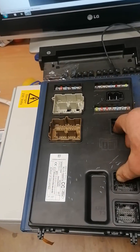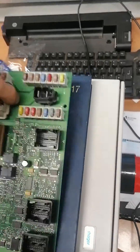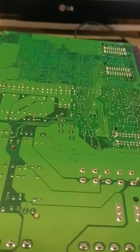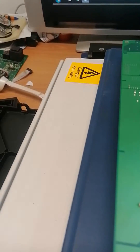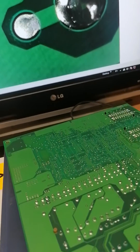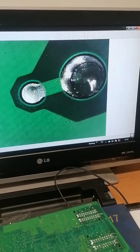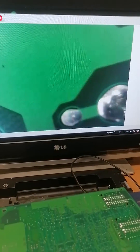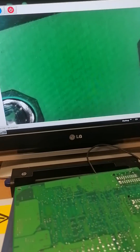I've taken this out and we'll have a quick look at the board. First thing we notice — lots of spurious codes, sometimes communicates, sometimes doesn't. Looking under the digital microscope, you can see that's just one pin we're looking at here, and it's absolutely destroyed with cold solder joints — the whole board is really bad. These are all going to be high resistance, and you can see the way the solder ends up oxidizing and receding.